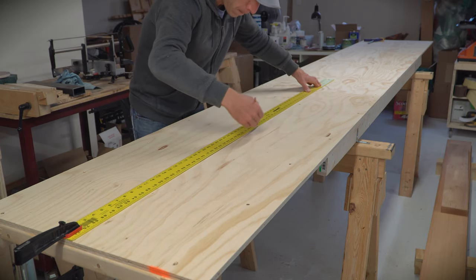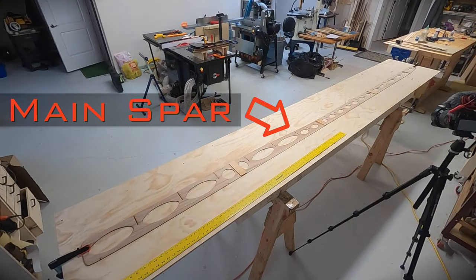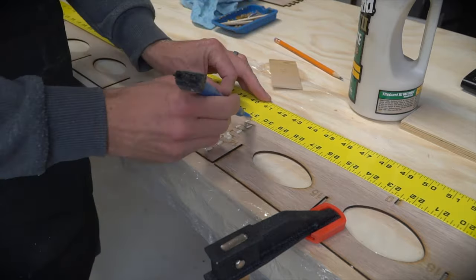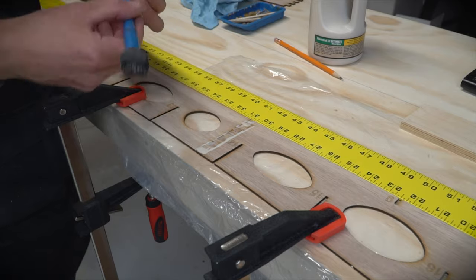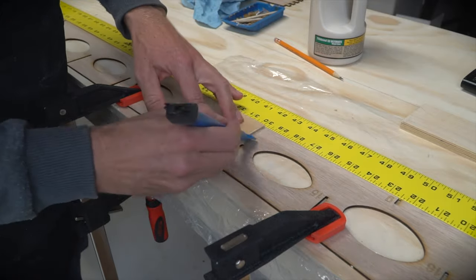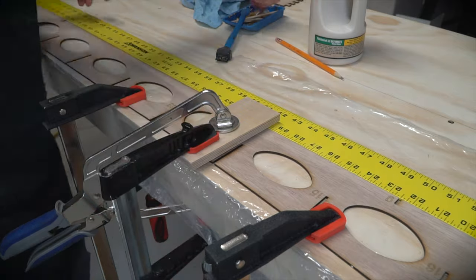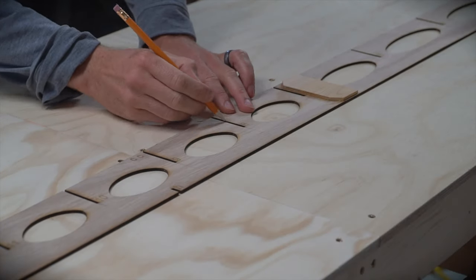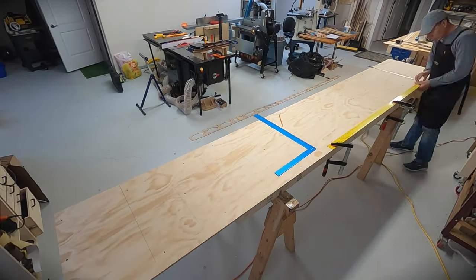To make this happen, I started by drawing a center line on the table. Now the ribs of this paddleboard are not evenly spaced along the main spar, so it made sense to use the slots in the spar to mark the location of the ribs on the table. But before any of this could happen, the spar had to be assembled from several pieces. Each piece has laser cut dovetails to align each section, and it was all glued together with waterproof wood glue and a thin piece of cedar as a doubler at each joint. Because the majority of the keel line of this particular design is flat, I used a long ruler to make sure each section aligned perfectly with the next. With the main spar now assembled, I used it to mark the rib locations and then drew perpendicular lines across the table at each mark.